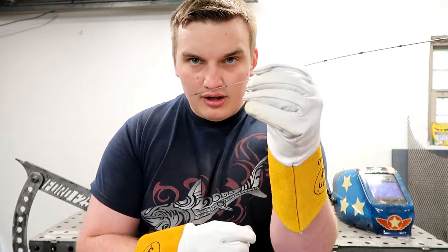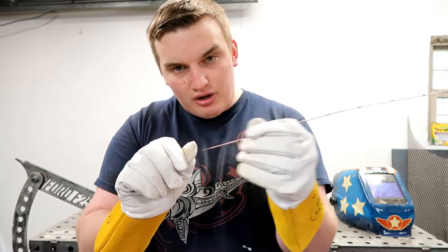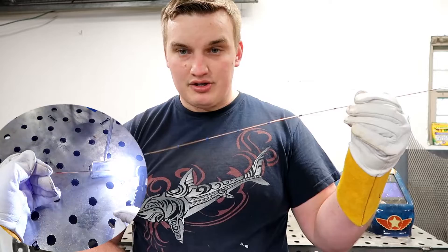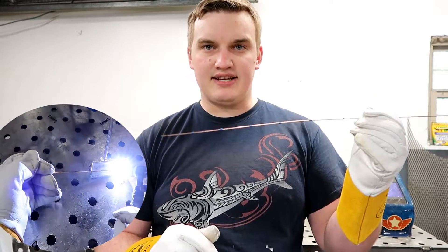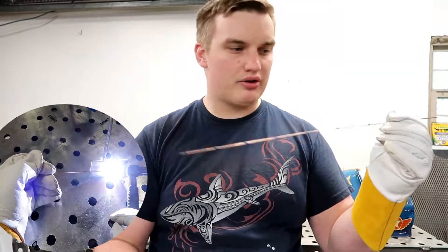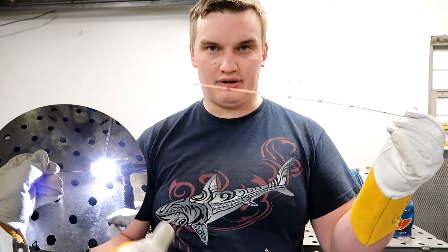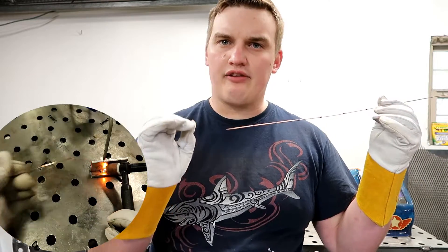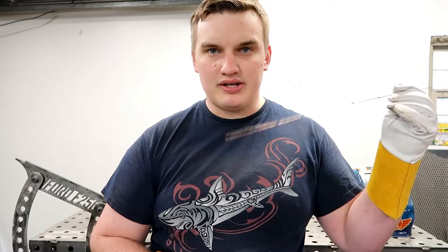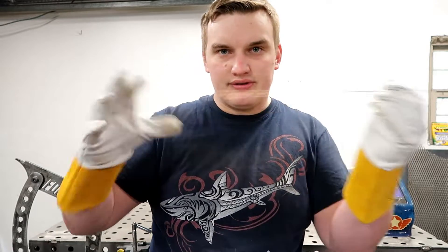One is if you're holding it down close you can still get a steady spot, but you're only going to be able to make like an inch-long weld before you're burning your gloves or your fingers or both. The second reason is when you're holding it out farther to get that full length of your weld laid in, the sensitivity of your movement — your hand or entire arm — is accentuated by the length sticking out. If you're holding out there, this thing's going to bounce, and with a small precision weld you have to hit the nose of that puddle every time and that could only be an eighth of an inch wide.